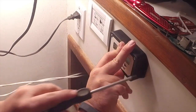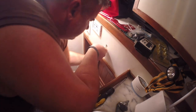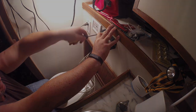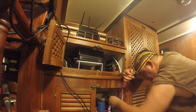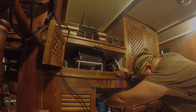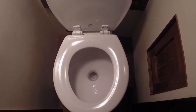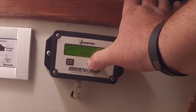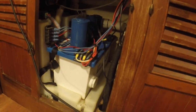Now it's time to mount the ElectroScan control panel. I'm marking the location, drilling a hole to feed the wire from back to front, feeding the wire through, and then mounting the control panel on the wall and tightening it with screws. In the home stretch now — connecting the 12-volt power to the ElectroScan control unit and hooking the ground between the toilet and the ElectroScan. Time for the big test: push the one-flush button, water should start coming into the bowl, then we hear the pump out and macerator, followed by the bowl refilling. For the integrated test, the ElectroScan says ready to flush — we push the one-flush button, the toilet flushes, and the waste treatment system begins running as well. All's working well.